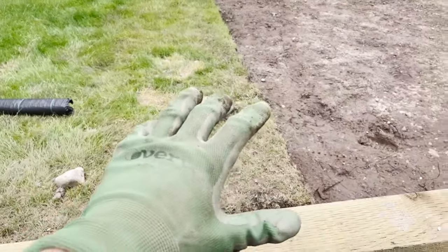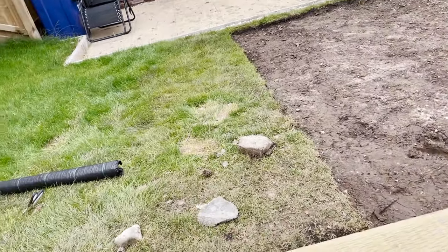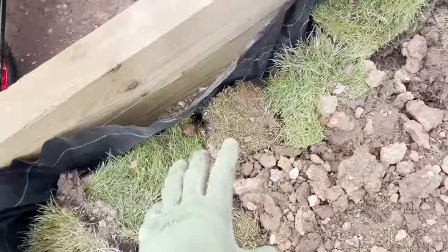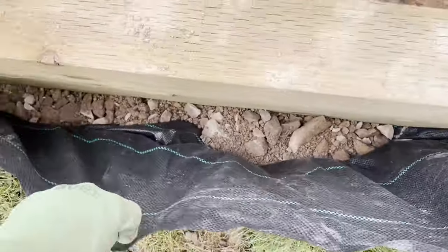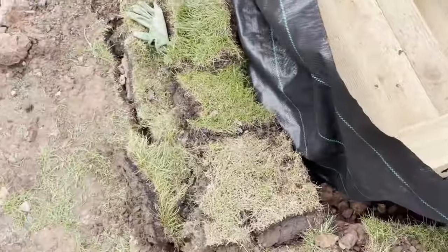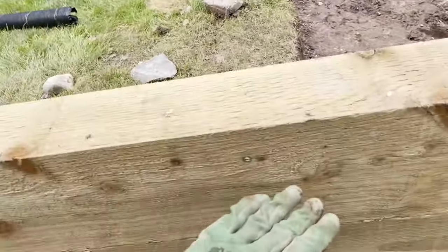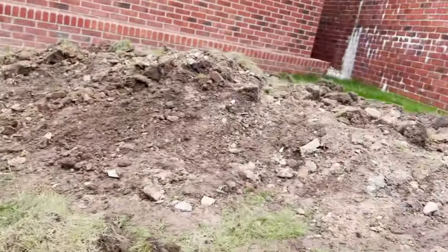Right, so the plan for today is to backfill the wall. What we're going to be doing is taking off all of this grass and the clay that's down there, and use it to level off the top here. To make life a little bit easier, we're using the big clumps of grass we pulled out to sort of build a bit of a wall at the back, so we can leave space for a level of hardcore. We're doing that all the way around now, and once we've backfilled this and got to the level we need — which will probably be about halfway up this final sleeper — we can start taking the rest and chucking it on top.